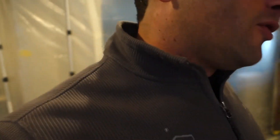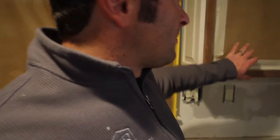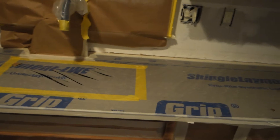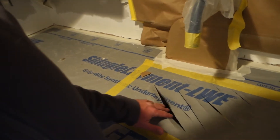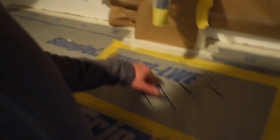Most of the time we're spraying everything inside. For this glass cabinet we're going to spray the shelves and the doors — not the glass, the color. Some of the other cabinets are still full. Before we tab everything up, I'll put plastic on the ceiling. As long as I can get my hand back in there to put masking tape inside, we're okay. You can see we outlined the sink, and we cut it out this way so stuff can drain inside. The end panels look great and everything is ready to go.